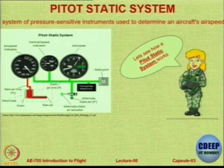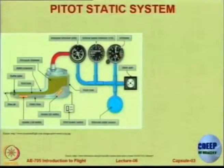The system consists of a pitot static tube which has an intake that directly measures total pressure, while the static pressure comes from the side of the aircraft through static holes. The difference between total and static pressure gives the dynamic pressure — half rho V squared — from which the value of V can be obtained. This is how the pitot static system works.